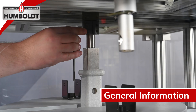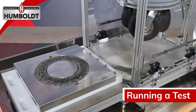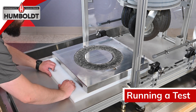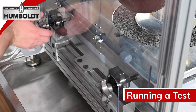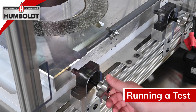The wheelbase can be removed for service using an Allen wrench. Place the sample holder on the white plastic platform, then, using the handles, slide the platform from the staging area into the testing area. Make sure that the white plastic sample platform touches the very back of the testing area. Use the adjustment knobs on each side of the three-wheel polishing device to center and secure the sample holder into place.